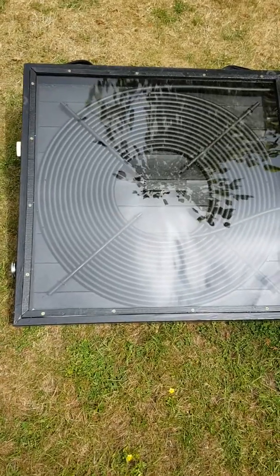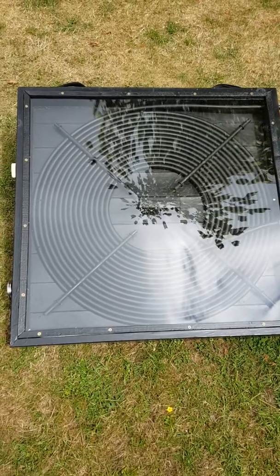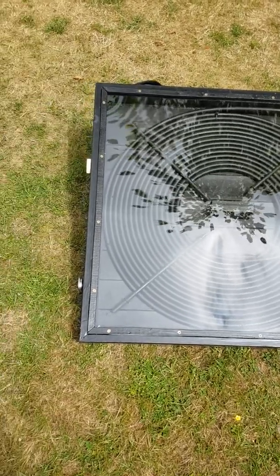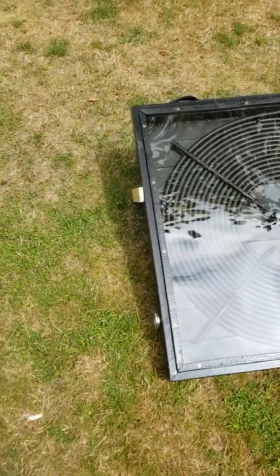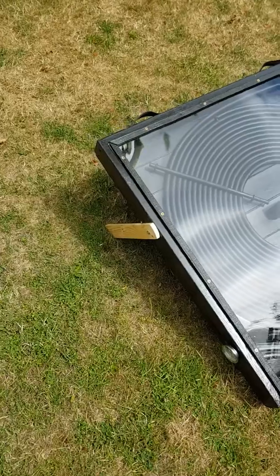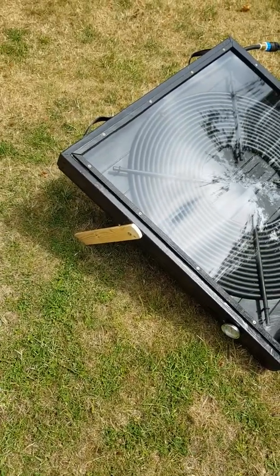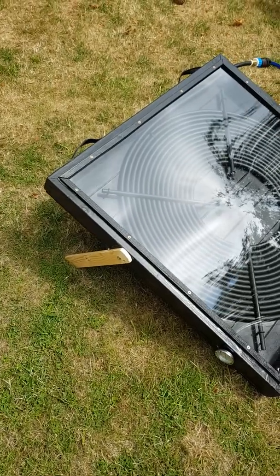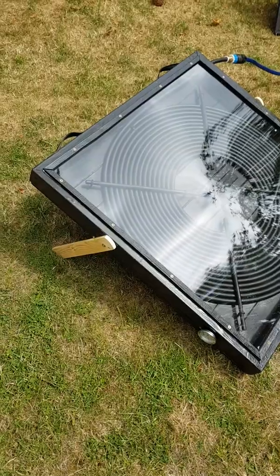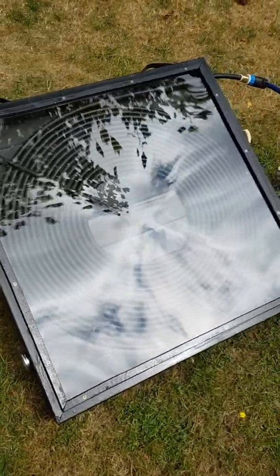Having looked online, I copied the idea from fellow YouTubers, but what I did find is some of the information wasn't there that I needed. Initially I painted it in some oil-based gloss, but only then to discover that it needs to be done in matte. The advantage is that the outside is done in gloss, which means it is waterproof, but by doing it in matte you gain approximately 7 degrees in temperature. So I then painted all the inside in matte.